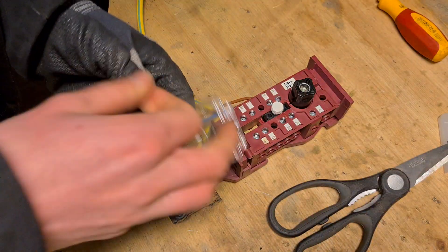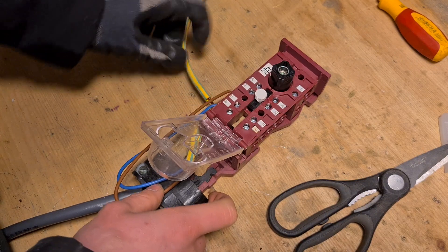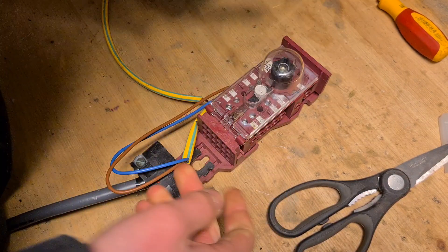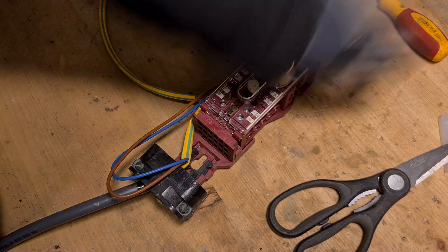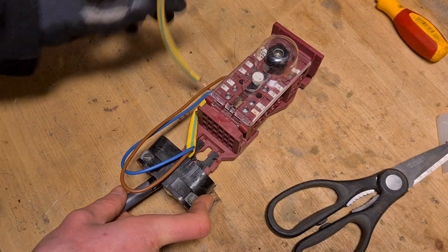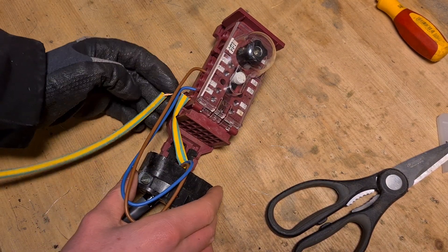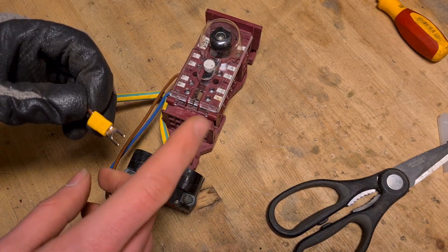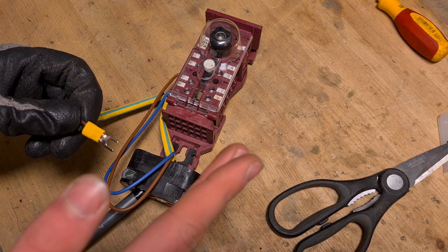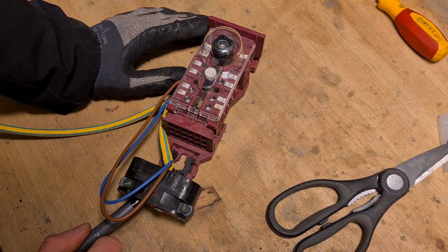This is pretty much how you connect a fuse box. With this connection where the ground and neutral are connected, I'd recommend not using this type of fuse box, and I'll show in a separate video the type you should get and how to connect that one — which is not much different from this one. You can still use this type if you take the ground wire off and directly connect it to the pole. When you do that the fixture isn't grounded, but mostly with a metal fixture, just grounding the pole is more than enough. That pretty much was the end of the video — thanks for watching, have a nice day and see you in the next video.